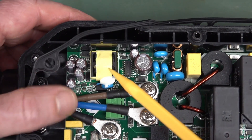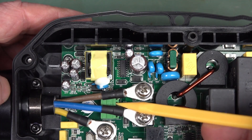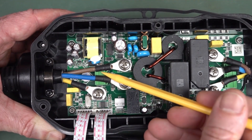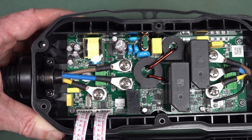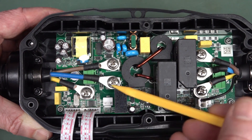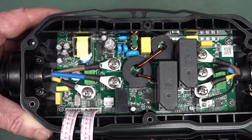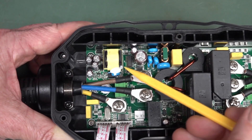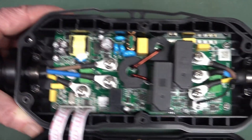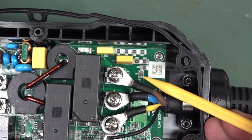This is the output here and this is the input. Up the top here looks like this is just the mains power supply, with the mains coming in again. We've got another — or maybe these Phoenix connectors are here for factory test, because I don't know what version of the product would use Phoenix connectors. Maybe it wouldn't be too hard to do bed-of-nails testing when you've got huge big contacts like this — you could have a big lid with pins that come down and make contact, and then test your boards at the production factory stage. But anyway, this would be an isolated switch mode supply for powering the circuitry.